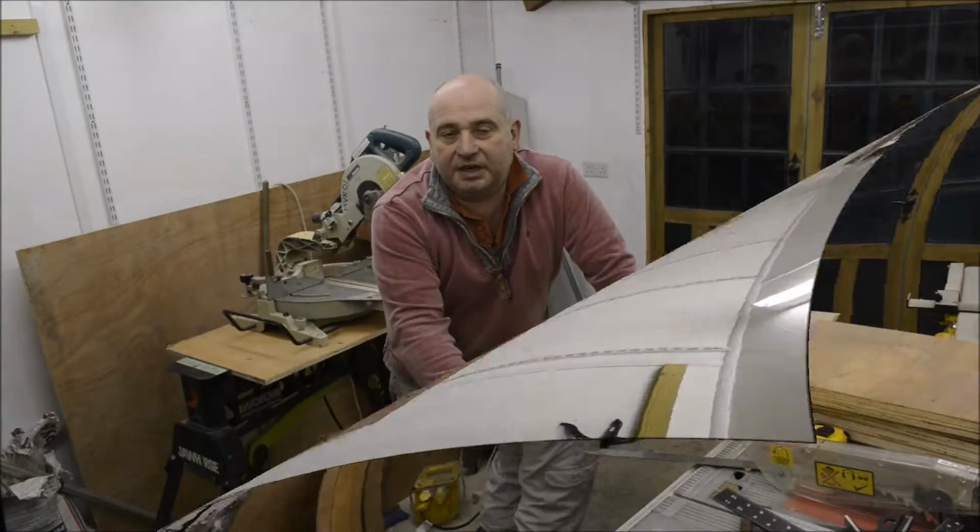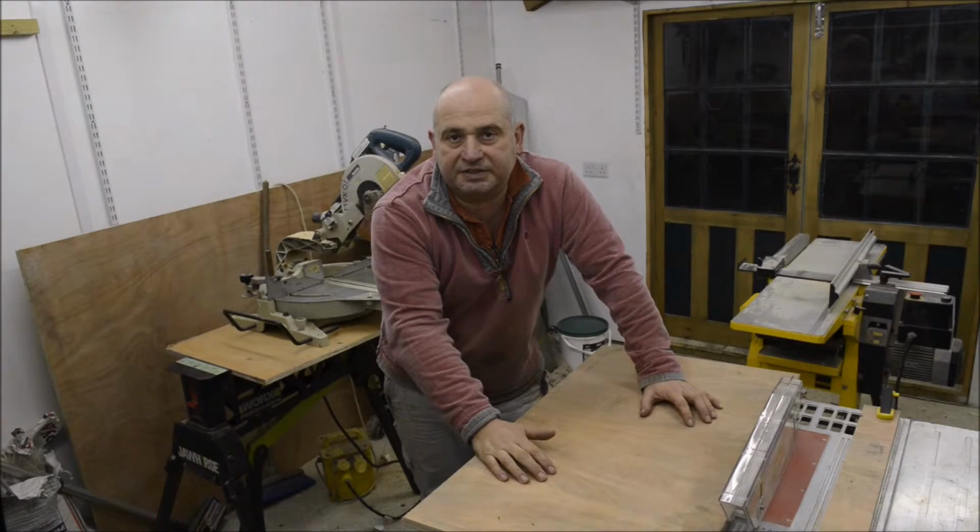I've cut all the sides to the four carcasses that I want to make. I don't have enough material to do solid tops and bottoms, so I'm going to cut some strips about 110mm wide, forward and back, top and bottom, and I'm going to dowel them and put them into place and make the carcasses up that way. The bench will hold them square and I'll fix them to the walls and whatnot, so I'm not overly bothered about not having solid tops and bottoms.